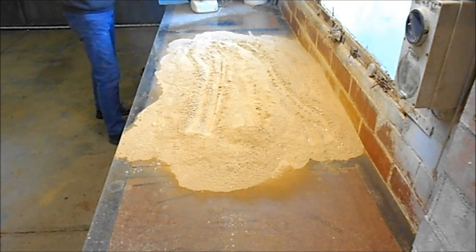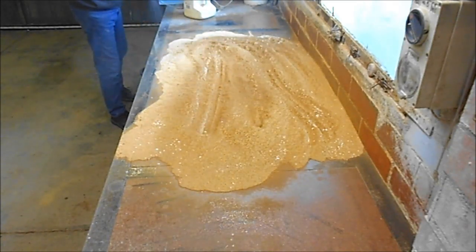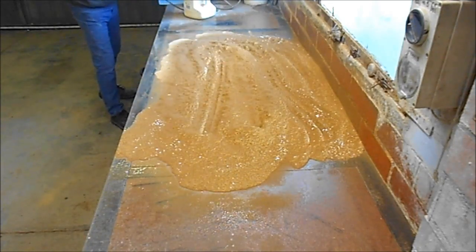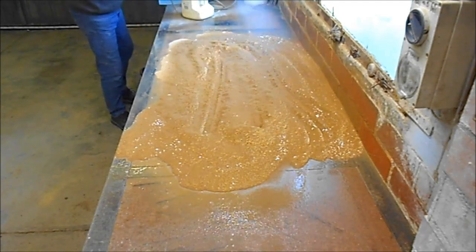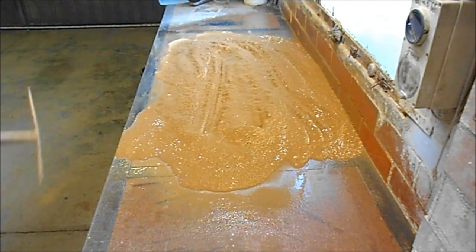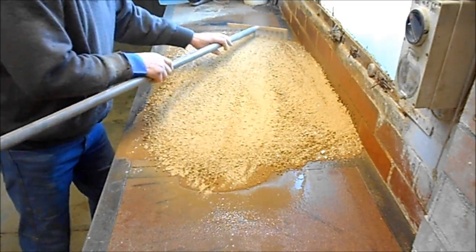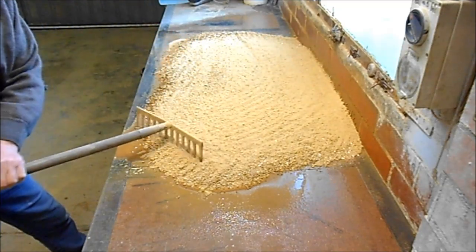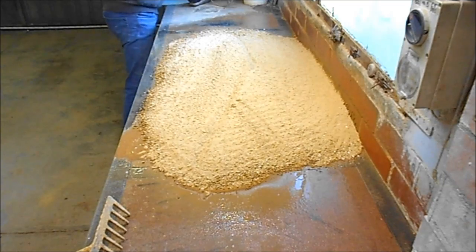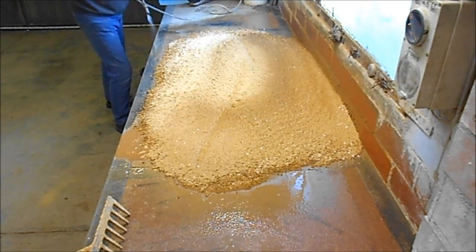Now the water — I add it with a fine spray, progressively and slowly. It'd be nice if I had a sand muller to do this — I want to contemplate building one, but the older I get the less likely I am to build it. There's a lot of work in building one of those. So all I do is just push it around with the rake. Note how the sand's reacting to the rake — at the moment it's going through very easily. This is one of the ways you can tell how much water you've got in the sand when you're getting close — by how it reacts with the rake.